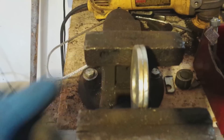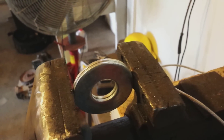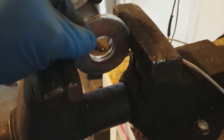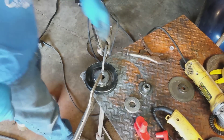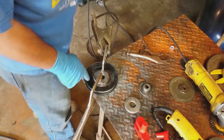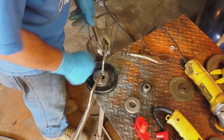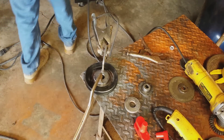I've got it set up in the vice — I've just got it pinched up inside there. As you can see it's got it trued top, bottom, and sides. What I'll do is lay a couple of tacks right here on the top and a couple on the bottom side, then I'll be able to weld all the way around it and it'll be a good solid weld. Let me get that done and we will come back. Got my washers welded all the way around. Now what I'm going to do is tack weld it, flip it over, and measure on each side to make sure it's pretty well centered. Let me get my helmet on.